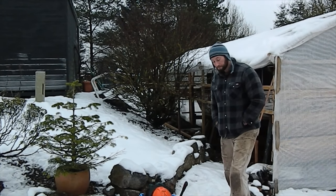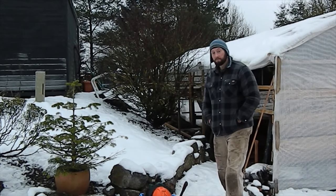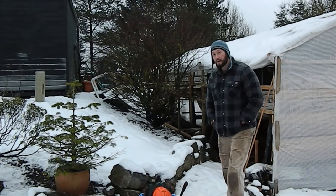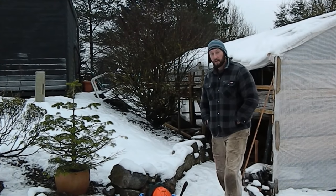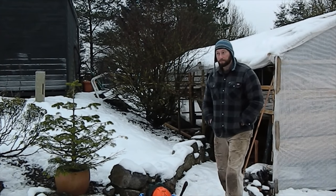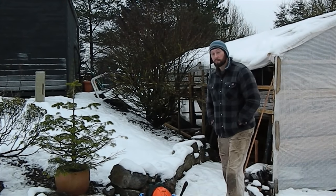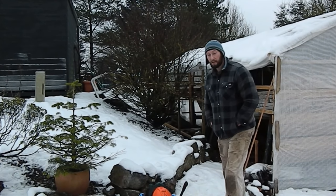to investigate it. The things I'm looking to try and get out of this tree are primarily knees, ideally a breast hook or two. If I can get some futtocks or some nice gentle bends that I can make some futtocks or sawn frames from, that's what I'm after as well. A secondary aim would be to try and get some long lengths that we can use for deck beams. However, I think that's probably a little bit unlikely.